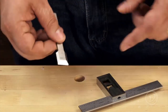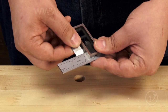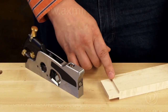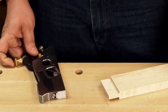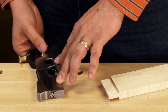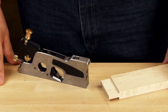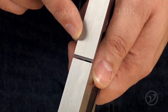As with most joinery planes, you're going to want to keep the corners intact and make sure that the edge of the blade is perpendicular to the side. Because shoulder planes reference one flat side of the joint in order to tune up the other, you want to make sure that the blade is flush on that side. Simply turn the plane onto its side, press down lightly on the body with the lever cap slightly loosened, and then tighten the lever cap again. This will make sure that the blade is nice and flush with the side of the plane, and you're ready to start adjusting the joint. You should also visually inspect the blade in the mouth to make sure that it is straight in the body.